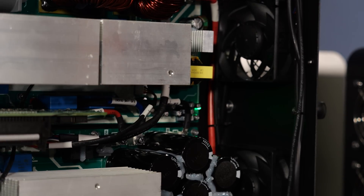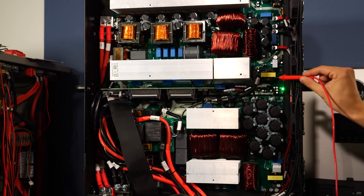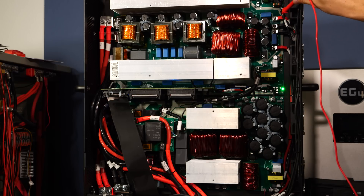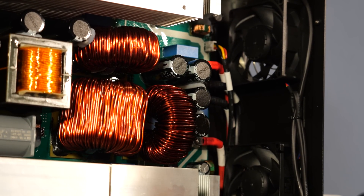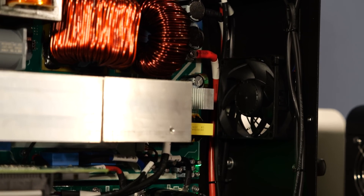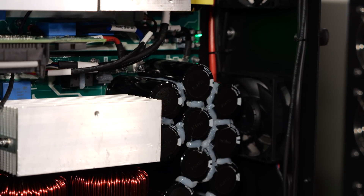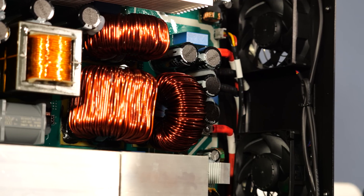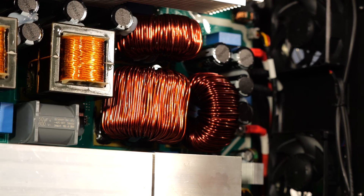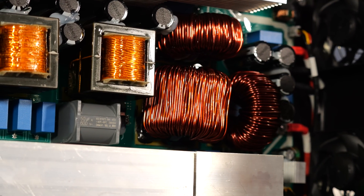So all of that complication gets pretty simple — right here there are three wires, a black, blue, and red wire — this is our high-voltage DC bus. Before the high-voltage DC bus goes to the AC inverter section, we add our PV power. There are four wires in the top right coming from our PV inputs where solar power is chopped up and brought to the correct voltage for the high-voltage bus. The round red things here are chokes, which filter out any interference at about 20 kilohertz from going back to your DC bus or PV array.